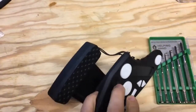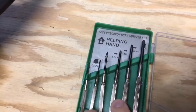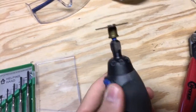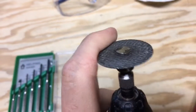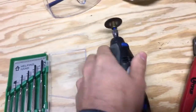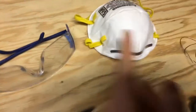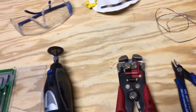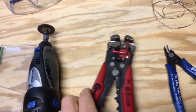You're going to need your Guitar Wing, obviously. You'll need some super tiny jeweler's screwdrivers, or precision screwdrivers, because you're going to have to pull out some really small screws. A tray like this is useful for keeping those screws from getting away. We're going to be doing some cutting of plastic and printed circuit boards, and I like to use a hand grinder made by Dremel with this little tip — I like these better when they're worn down for the precision work we're going to do. Also useful are wire cutters and strippers.